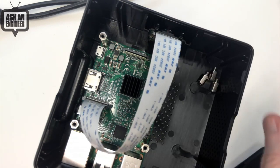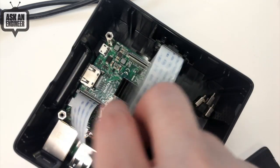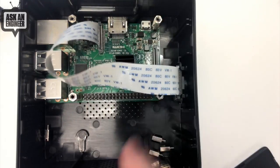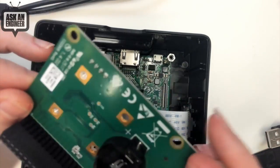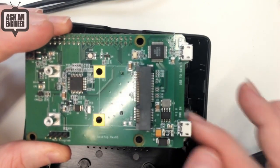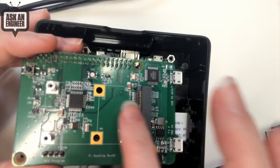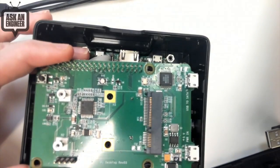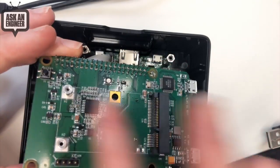You can now have your camera connected. This is the standard Raspberry Pi camera kit — you have the Raspberry Pi and then you've got the camera, and if you want to connect the display you can pass it out through one of the side notches. What you're really getting for the value is this add-on board, which has a buck converter with circuitry for power input protection, and a USB-to-SATA converter so you can plug in an SSD drive.